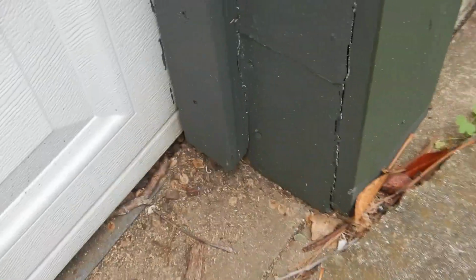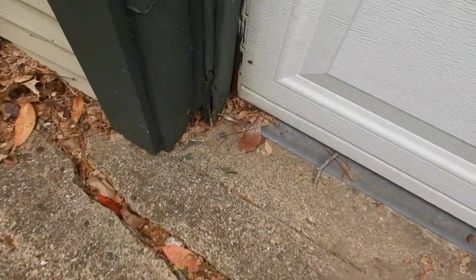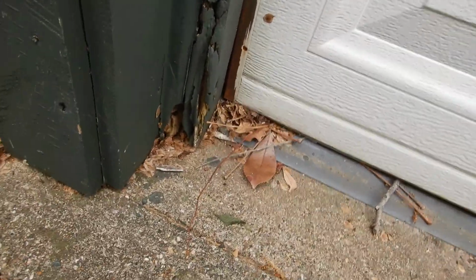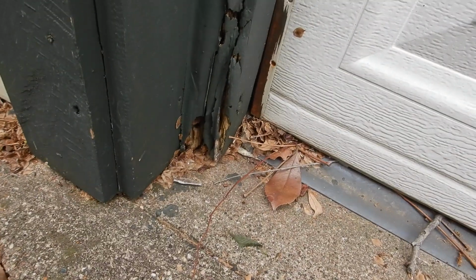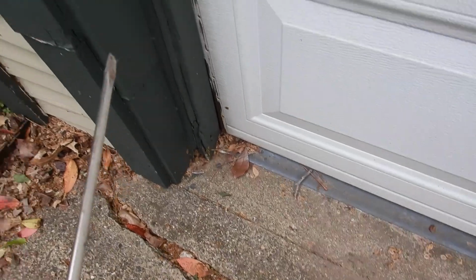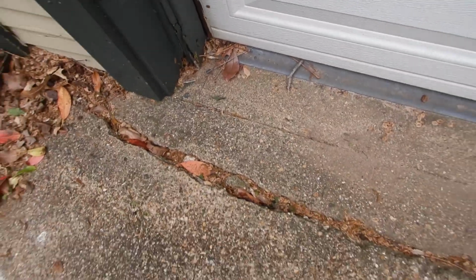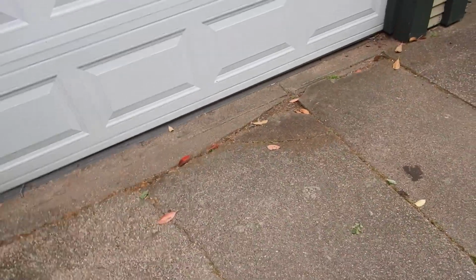Coming over here, we can see that we got some repairs to our garage car entry vertical casement. It's been rotting, and so what do we do? We just went back like we did to begin with. This is what happened originally. We got wood rot because of capillary action. Wood is cellulose. It sucks the moisture up from the concrete and rots the wood. They replaced this once already. They're replacing it again. You'll keep replacing it as long as that wood is next to the concrete.